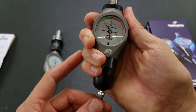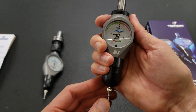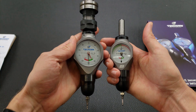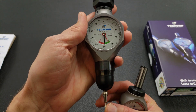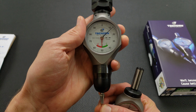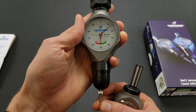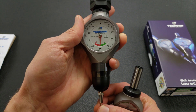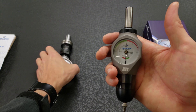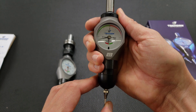After working it for a few minutes and moving it around, there's definitely less resistance than initially. But there's still definitely more resistance than the V1 Plus size that I already have. The V1 Plus — I thought it had a lot of resistance in the motion, like it feels a little bit sticky. In practice when actually using it on the machine, it seems perfectly accurate — it hits zero every time I've compared it to traditional edge-finding methods, and it's right on and much faster. But I was hoping a newer model, made just this year a few months ago, would be less sticky.